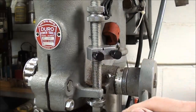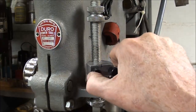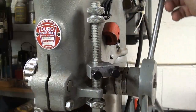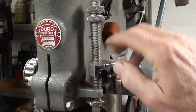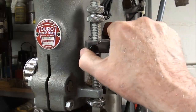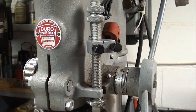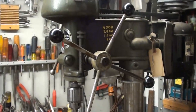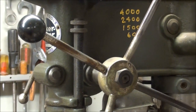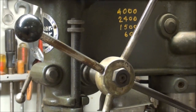So I re-thread it, and I'm going to show you how to drill it and thread it. You can quickly move it into any position on any drill press that has that size. I noticed from my three drill presses that they all have different sizes, so that is not something that anyone agreed on. And I'm going to do it for the Walker-Turner drill press — that's a finer one, that's a 5/8 fine, a 5/8-18 fine thread.